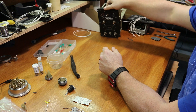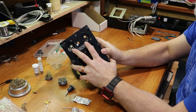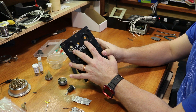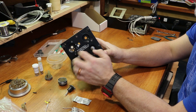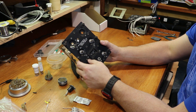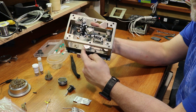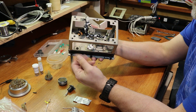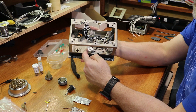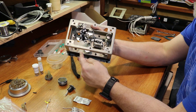What I do is take the panel down to its components. I'm working on two controls right now: the power and the elevation scan. I've got it completely gutted. As I rewire each one, I'll pull it out, clip all the wires off, desolder and clean it up, then map out the switch and only use the poles I need for the task.